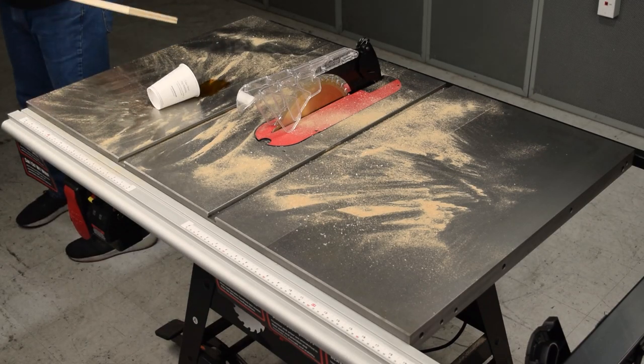The first line of defense against rust is to recognize potential moisture sources in your saw's environment. There are basically two ways water can find its way onto your saw's table: condensation and direct contact. Other than the obvious spills, there are some sources that are easy to overlook or forget, especially since rusting is not immediately visible. Rust was caused by sweat from a handprint, paw prints, fingerprints, or perhaps a patch of slightly damp sawdust. This pattern may have been caused by condensation trapped under boards that were allowed to sit on the table overnight.